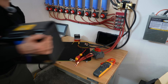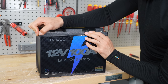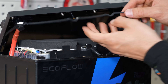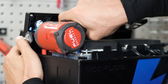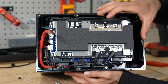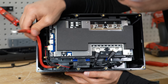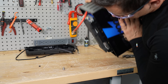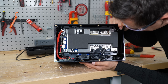These are hot — I need to put a fan on this thing before it catches on fire, but for this type of testing it's fine. Now the fun part — this one has little screws on the top. First, we have a rubber gasket so it's waterproof. Now this is what a battery is supposed to look like: cell holders that integrate to the BMS, nothing touching each other, everything insulated, glued, and torqued. We have conformal coating and everything looks fantastic. But it's potted — the whole bottom of the battery is potted, making it nearly impossible to disassemble.